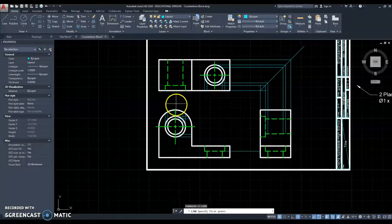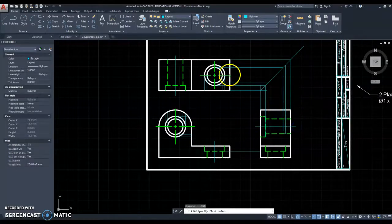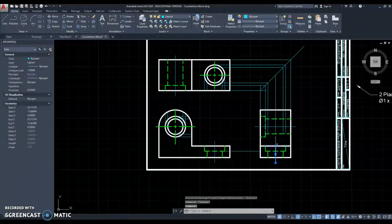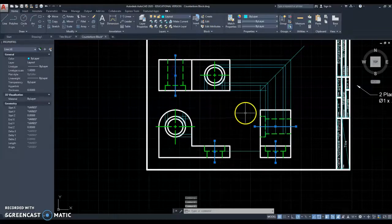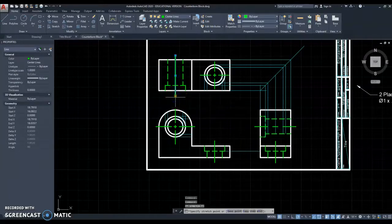I need those same center lines shown in the other views. I need a center line that comes here — I'm just going to track from that one — it goes outside the object to outside the object there. This one goes from there, I'm going to track it and start it outside the object, down to there. I'm going to take this one and track it across to there and down to there, and I'll just trim it off. Those four lines I'm going to change to center lines — not hidden, to center lines. This one has a nice dash in it, this one does not. I can either change the scale or make it just a hair longer. These two I can't make long enough, so I'm going to change those scales down to 0.5, and that looks nice.